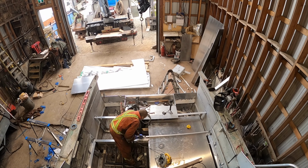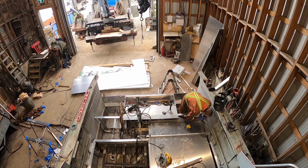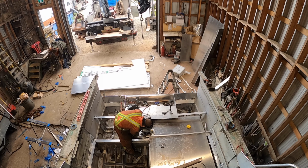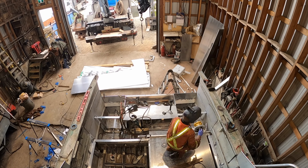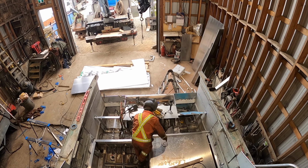So I just slip the plate into place right now and line it up square to everything, and then I can mark out where I want the length of the plate to be, and then around the air boxes up front too. Like you can see, it's not quite up against the side gunnel, so I mark out where the air boxes have to come. It's way easier than trying to measure it. If I had to put everything else in place and then tried measuring it, I wouldn't be able to put the 4x8 sheet up there to fit to it. It just turns into a problem. We don't want to be replacing plates because I cut it wrong, right? So it's easier just to put this into place. I could measure it, but like I say, it's just one more thing that you have a problem with.